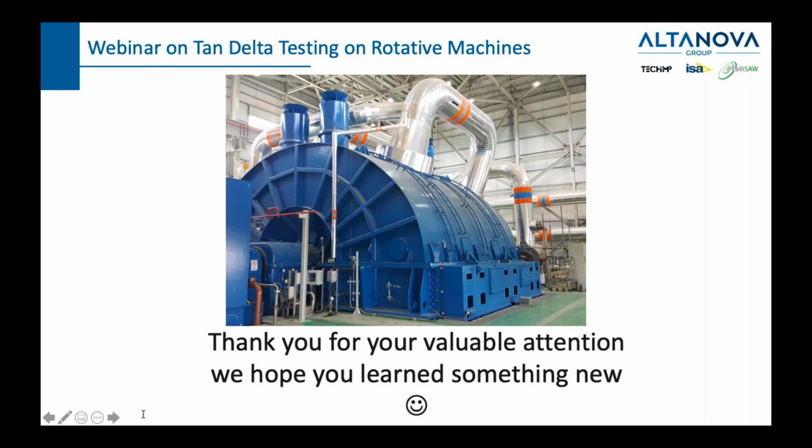For generators, if tan delta values are high, you said we also use a reactor. If you have high tan delta values, then you have high tan delta values. The reactor will not reduce the tan delta values. Without the reactor, you might not be able to do the test, because if you just have the TD 5000 without any reactor and you have a big generator, it will stop working and tell you that the burden is too high. So that's when you need to buy a reactor.